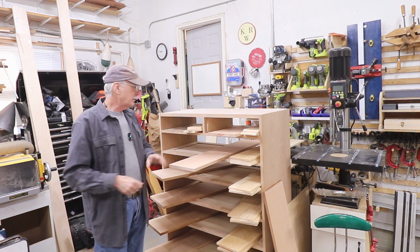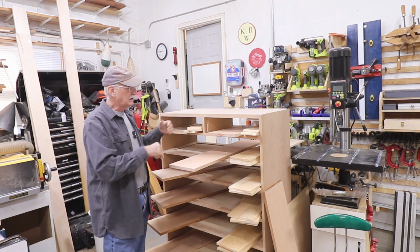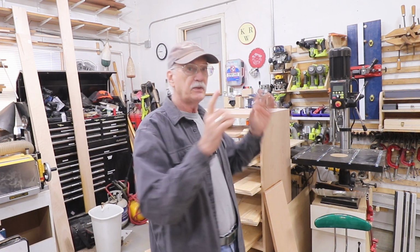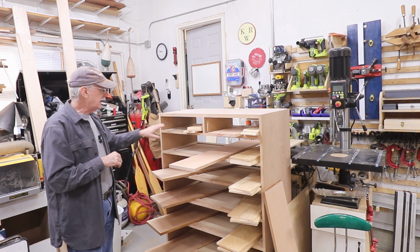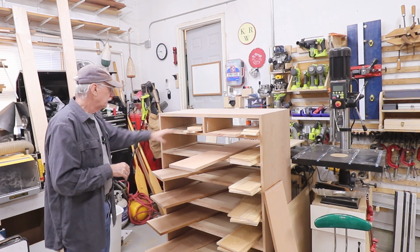What I'm going to do is build one, maybe two of these drawers, the top ones, to demonstrate the process. Again, it's dovetails and gluing and bottoms. Another concession to plywood on this build is going to be the drawer bottoms. I'm going to make them out of 1/4-inch plywood. The back of the cabinet, I'm hoping to do with pine, but if I have to, I'll use plywood, but I want to use pine.